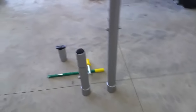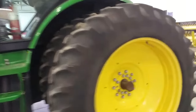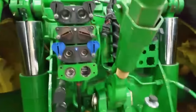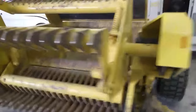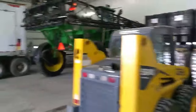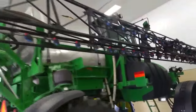It's a model 220 from looking at the book. That's another thing I'll be working on. We've got this one in here doing some maintenance — checking all the levels and fluids. We did have one hydraulic coupler in the back that was leaking pretty bad, so we pulled that out and we'll put a kit in there and rebuild it. We got the rock picker in here too — we went through it and made sure it was good to go. You can see we've taken some delivery of seed, some of that's been here a few weeks already.